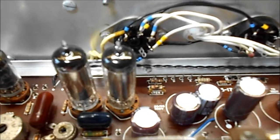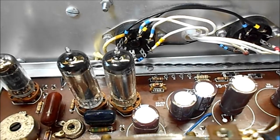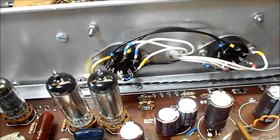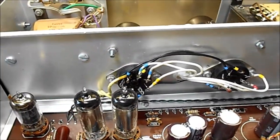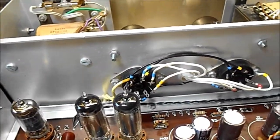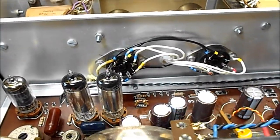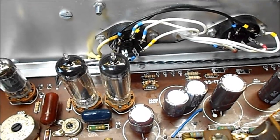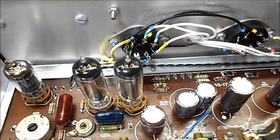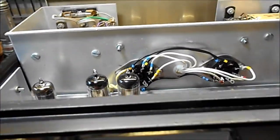That's a 470k ohm resistor. I had stuck a 470 ohm resistor in there. That's R12, and that's the voltage divider between the regulator and the control voltage tube and the pass tubes. When I pulled that out, I didn't have a 470k. I had two 240ks, which turns out it's 476k ohm. It measures out with the two twisted together and put in circuit.